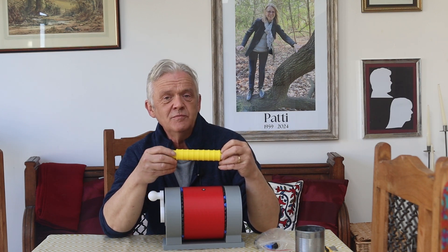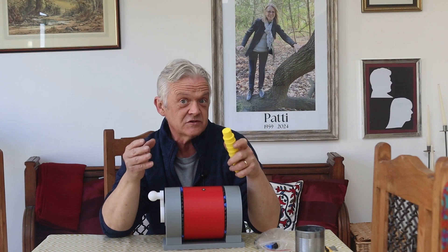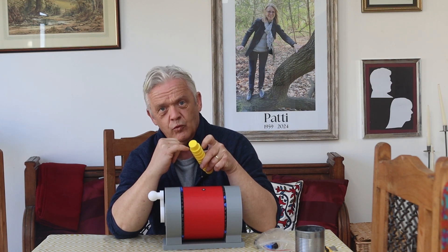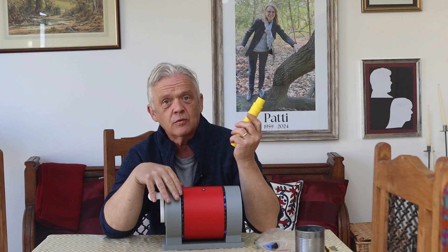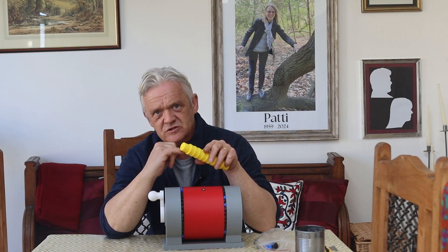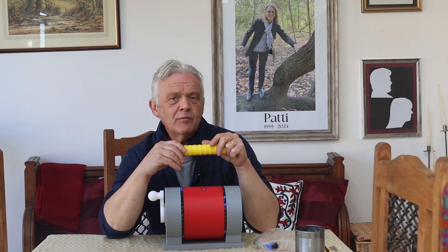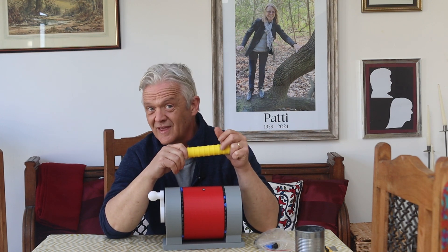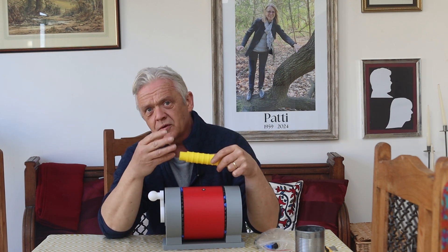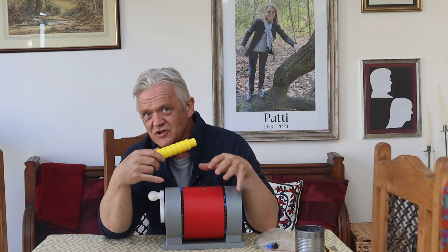The other thing we've lost is the ability to get huge reduction ratios. Because this is a working model I've made it fairly chunky so we can see what's going on, and this step is in fact quite large. We can take that step way, way down and get thousands-to-one gear ratios. This is only 10 or 20 to one — not that impressive. If we make the step really small we can get huge gear ratios. With a gear instead of a cylinder, though, we have a manufacturing limit, so we can't get thousands to one with a gear, but we can with a cylinder. So we've given up ease of manufacture and the ability to get a ridiculous gear ratio in a single drive by making it easier to turn.